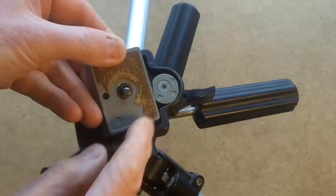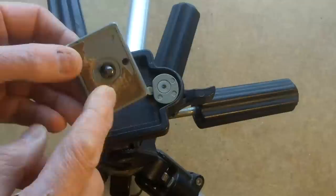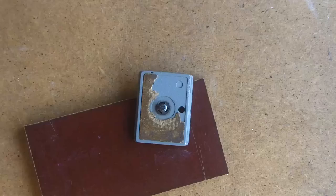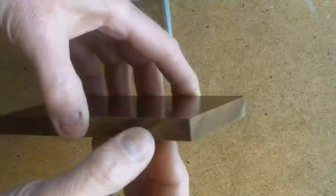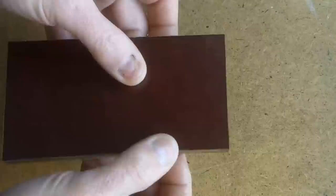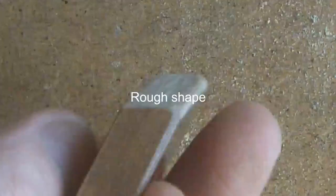What I'm going to do — I need to replace the cork there — is make a section that looks like this, then drill and tap it and arrange to hold the monopod over it. I did think about drilling and tapping the original, but I don't want to do that. I haven't got a block of aluminium the thickness I want, but I've got this material. This is what's called CARP — it's made up of hundreds of layers of linen resin-bonded together, so it's very, very tough. It's a laminated material, but I think it'll be fit for purpose.